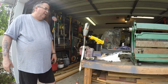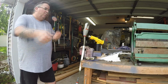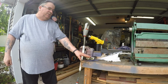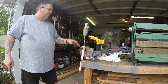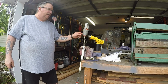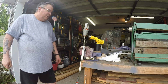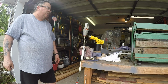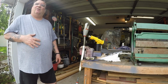And when they're both ready, then I can take the zinc and pour it. I'll turn this on first, take the zinc and pour it, and as I'm pouring it, the vibration will force it down into all the tiniest nooks and crannies, and you'll have a solid zinc plug in there, and this won't fall apart. Okay, very nice. Okay, but that's the thing I'm waiting on now.